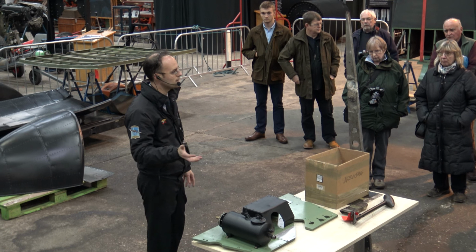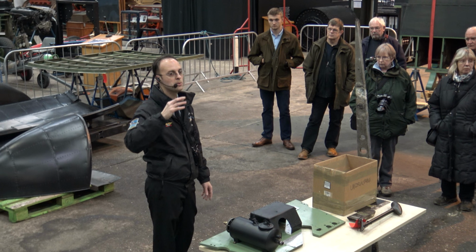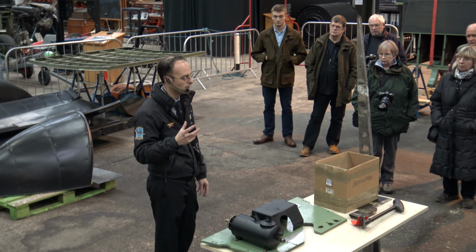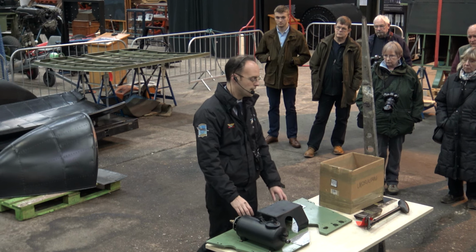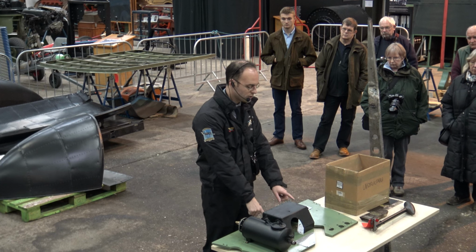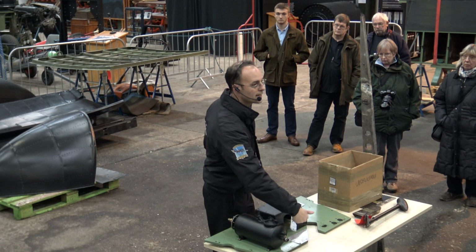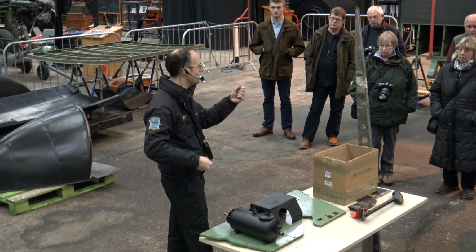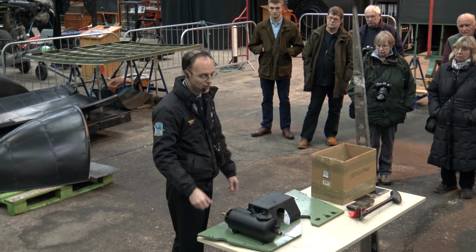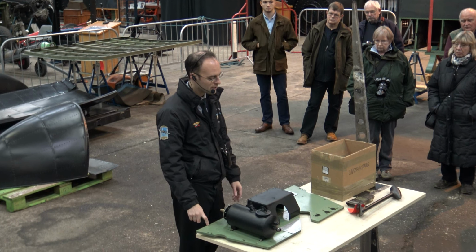So when we run the aircraft, if you see a ground crew member jump up on top of the wheel and stay up inside the wheel, the undercarriage well, for a while, he's actually at this panel, and this is where the fuel primers sit, the gas primers, and the fuel cocks for priming as well. Also, just up in here is where the trolley accumulator attaches, so that's the ground power where you plug it into the aircraft. So it's a very important panel with the priming and the electric side of the aircraft.